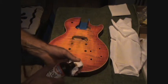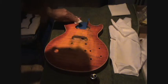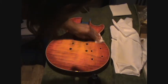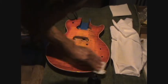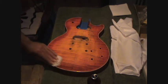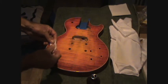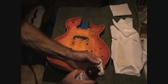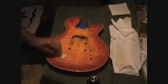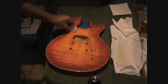Taking yet another clean piece of rag because it's swallowing this oil on the first go. Chuck a bit more on the cloth, and I'm just thinking of running around those outsides again. Just hungrily taking all this in. Give this kind of last pass like this, and you can see there's quite a lot gleaming on the surface there. It doesn't need to lay there for any length of time, I don't suppose. See, it's picking up a bit of colour. Turn the rag again. There's quite a lot of oil on the cloth, but hey, I'm not going to be pedantic about trying to work all of that right the way through. I'm going to take another clean piece of cloth probably in a moment and just give that a good wipe through. Okay, quite pleased with that.